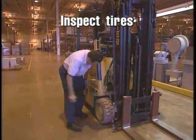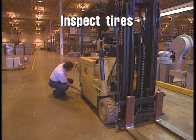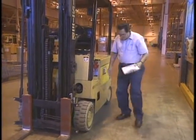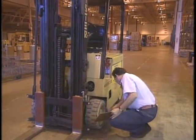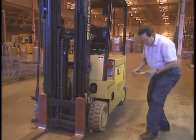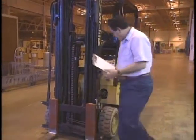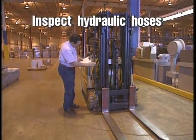However, from the operator's standpoint, it's also for your own protection and that of other workers. They're counting on you. Regardless of your level of experience, you need a safe lift truck to operate safely. Trucks must be inspected before each shift. In order to perform an adequate safety inspection, remember to use your checklist, checking off each item one at a time. Also, depending on the truck you will be inspecting, the location and function of controls may vary. Refer to the truck's manual for specifics. Don't get complacent. Check each item.